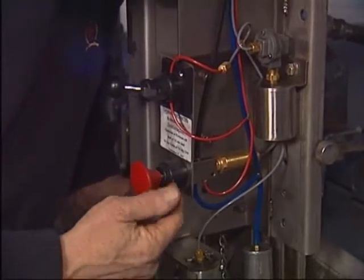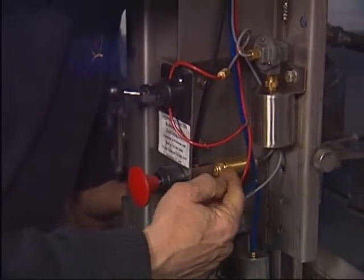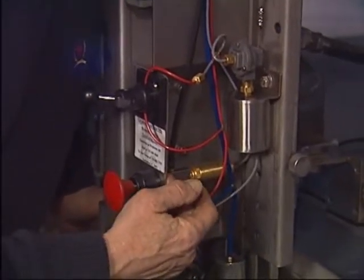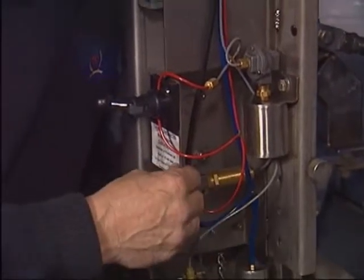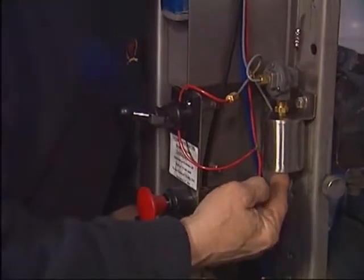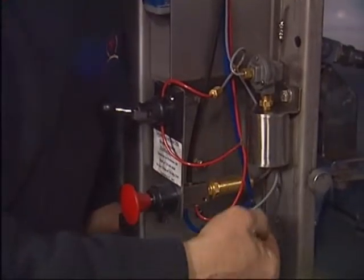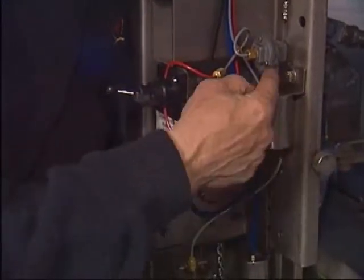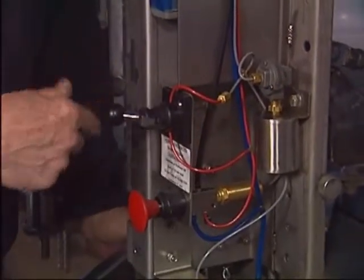Above all of that is the main valve assembly: the red button, a nose piece, the four-way valve or PT421, and a pressure-sensitive pilot. I'll come back to those names several times so by the end of the tape you'll be familiar with them. The end-of-milking timer is basically nothing but an air chamber; it comes in various heights and therefore various timings — 5 seconds, 10 seconds, 15 seconds, 20 seconds, whatever you want.